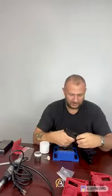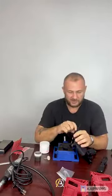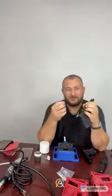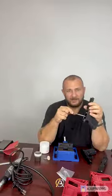And that helps to make sure you get any little burrs out of there. So that is one way of doing it. Another way is after you've finished your milling, use that sandpaper, get in there, clean up those edges. Any burrs, any little pieces sticking out will prevent a smooth operation. That's where also your small files come in. You can get in there, get off those burrs.